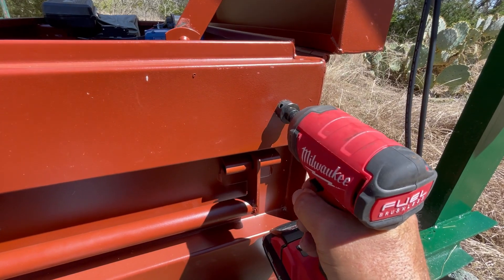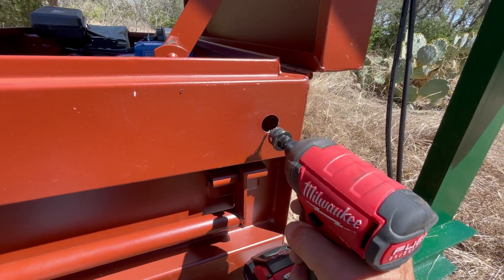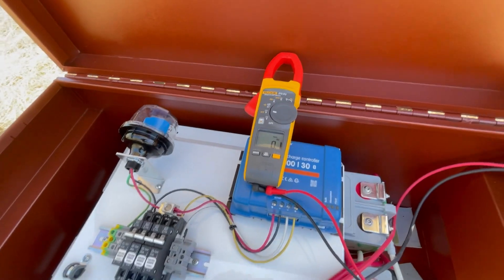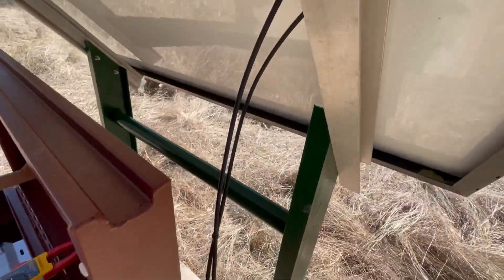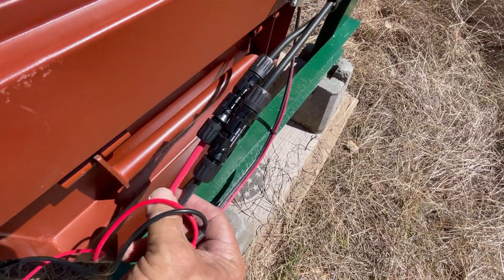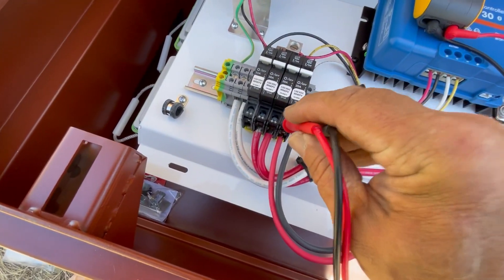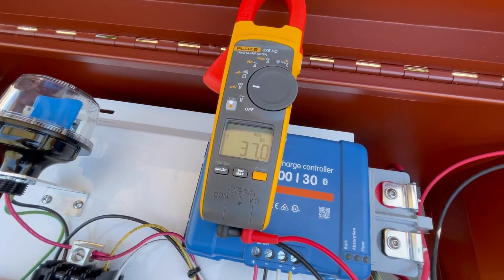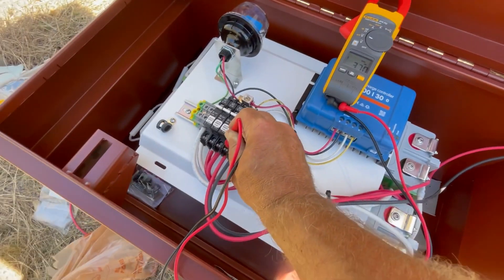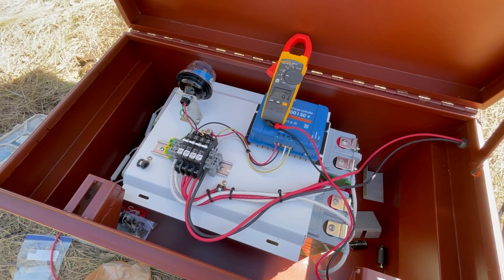Drilling, drilling, drilling. Half-inch knockouts — Milwaukee. That's an epic tool. I've got the panel connected. Panel coming down — make two MC cables. I like using red, obviously, for the positive. Let's make sure polarity is accurate by measuring. VOC is 37 volts. Let's boot this bad boy up and make sure our AGM battery programming is correct, and then on to the next step.